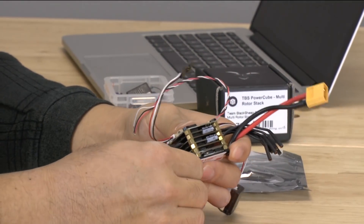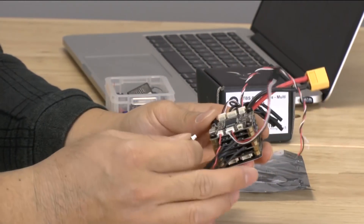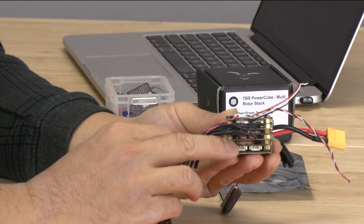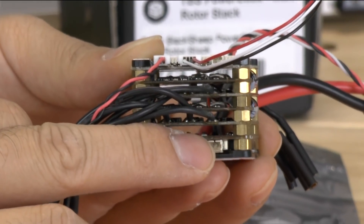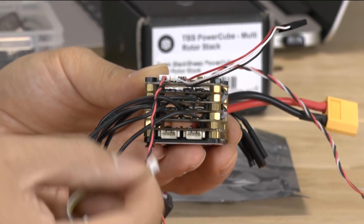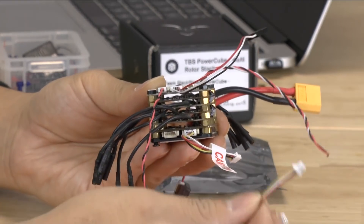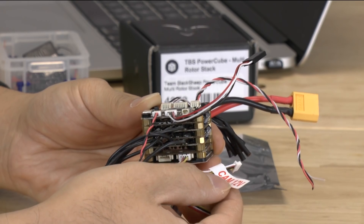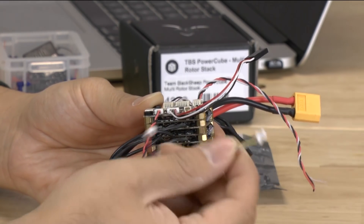The interesting thing about this is that you can actually plug in the wires wrong on the power distribution board. You actually have to look on the board right here up on top — it'll have a marking that says VTX and the other side says CAM. So you want to take your CAM one and put it on the CAM side because that's actually the 12 volt power. Because these wires are essentially the same, that's 12 volt power and you know that based on the label.